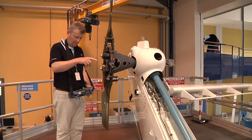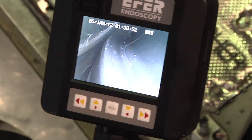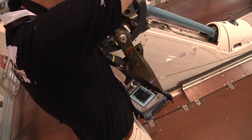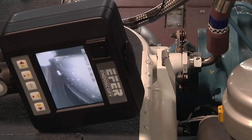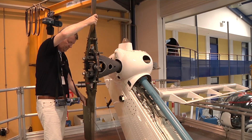In other words, the first tool ensures the correct positioning of the second. The ultrasonic parameters are adjusted before the start of the inspection. The US inspection involves watching the evolution of the ultrasonic signal by rotating the wheel to be inspected to cover the integrality of the area via the rear rotor.